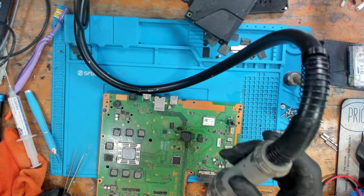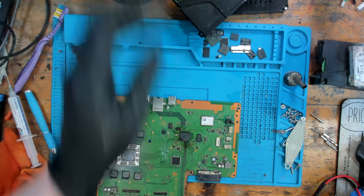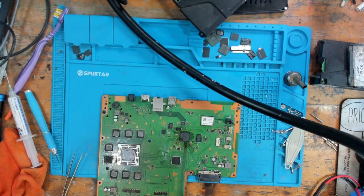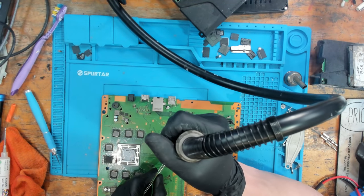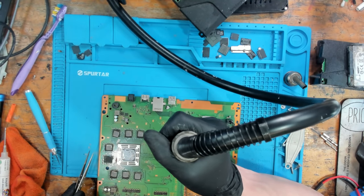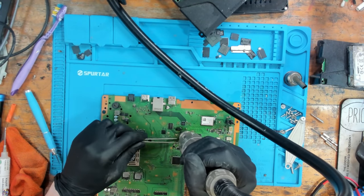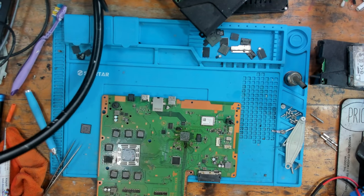Right, I do believe that this Southbridge is basically stuck to the board because there's liquid damage under there, because that is not moving at all. I'm going to remove and replace this Southbridge. Okay,